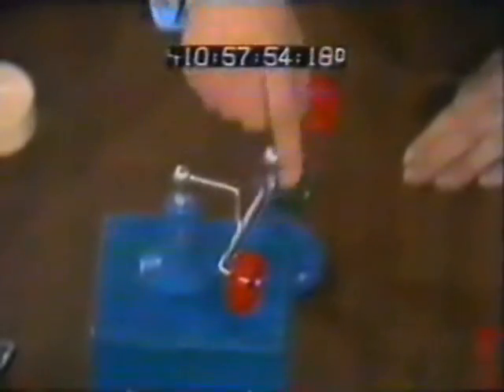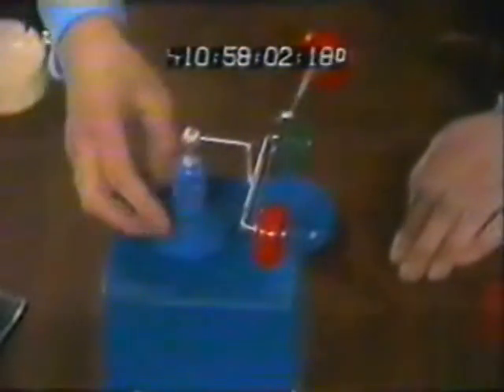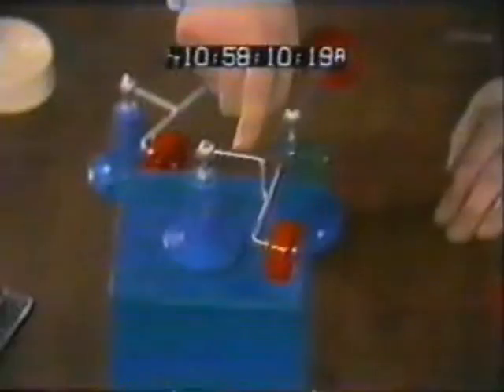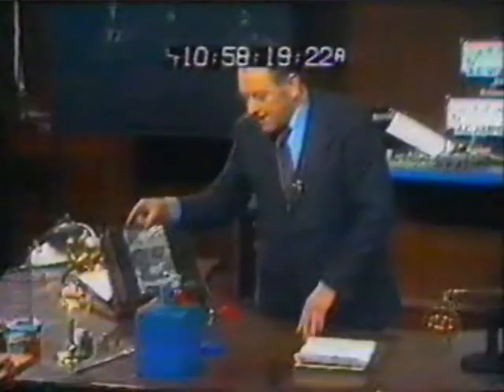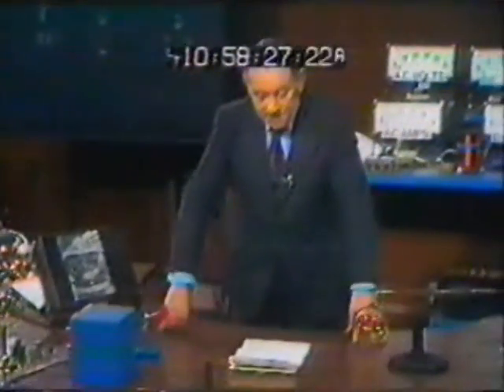There is much, much experimenting to be done. I've only tried offset gyros — relatively simple. What about this one: I counterbalance the mass of the gyro so that I've got gyro axis, precession axis, and torque axis — only the torque and rotor axis meet. Then you can go one stage further and have three axes where torque axis, axis of rotor are all missing one another as skew lines in space — what might that do? And we haven't yet started taking energy out of the rotor, which is what an electrical engineer would call radiation. All this and more must be done. Even the mathematics is not beyond A-level. The subject is so new, although it's a hundred years old — the seas are so uncharted. Edward de Bono encourages us to do lateral thinking, and his books contain delightful examples.